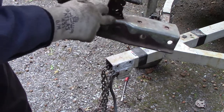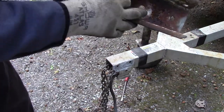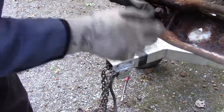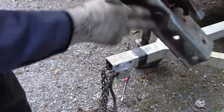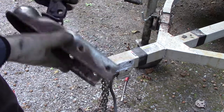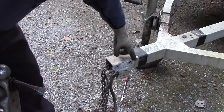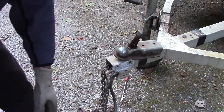The second time, the coupler fell off my ball on the truck because everything kind of rotted out here. You can see it's just all rusted out. I knew I had to get a new piece, but what I didn't know was all this Alka-Seltzer corrosion down there. I've got to get a new coupler no matter what, but I can't just cut the bad section off because I don't want the tongue to be too short.